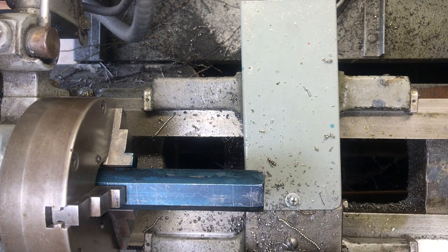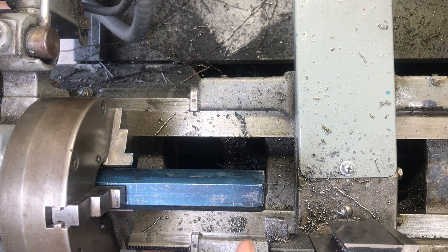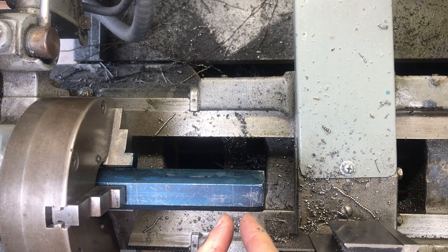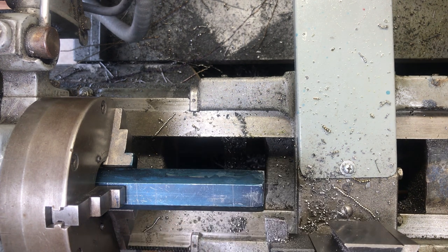I've got some sections marked out. I'm doing a roughing operation here. This section will get one set of diameters, this one will get another set, this will be actually full diameter, and then I'll be tapering it down here. But I'm going to rough it out using standard processes to get it down to near size that I want. Just make sure that's tight.